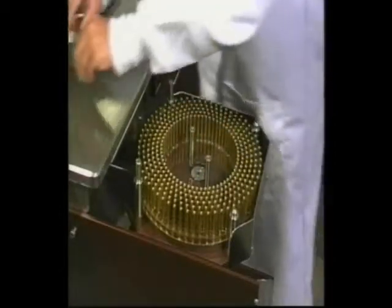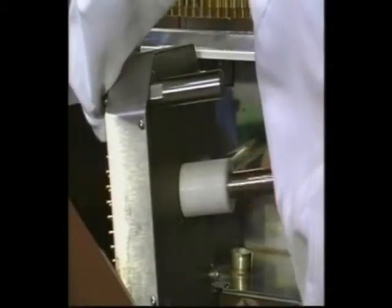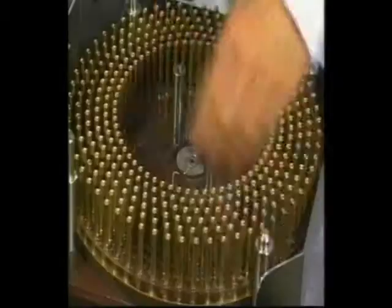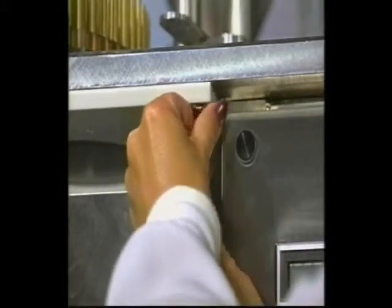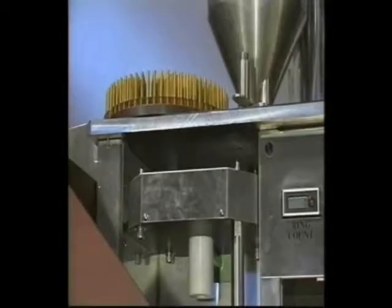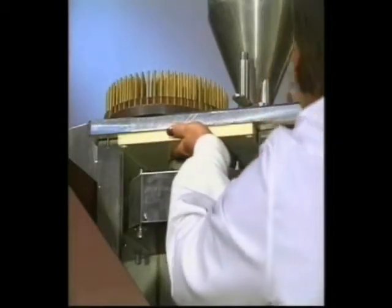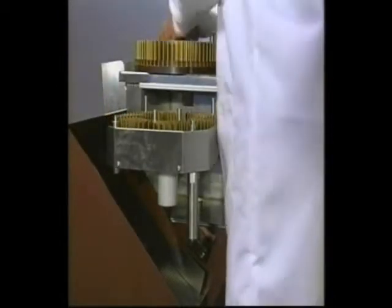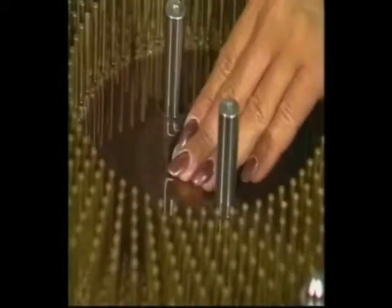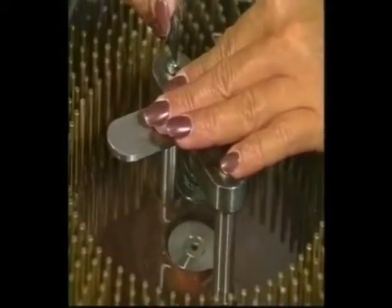Next, move to the closing station. Start by taking the lock off of the closing station. Rotate the closing ring to one side and take out the screw and washer that hold the shaft in. Pull the shaft out and the peg ring will come off. Remove the two screws that hold in the closing plate and pull it out. To insert the new size pieces, start with your new closing plate, slide it into position, and reattach using the same screws. Slide your new peg ring on the closing ring, then take the washer and flathead screw and hold tightly to the side as you push in the shaft and rotate until it is fairly tight inside of the ring. Put your lock position back on and turn your closing station over once to ensure everything is on correctly.